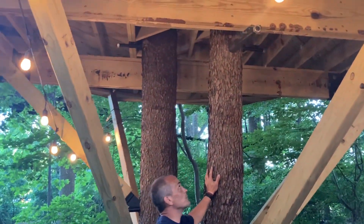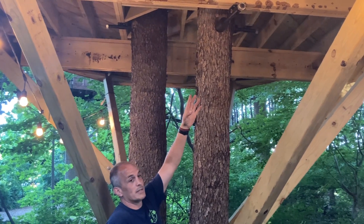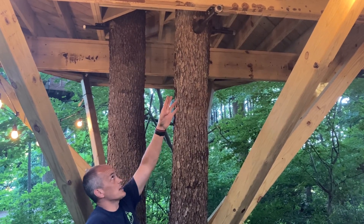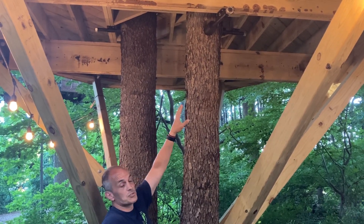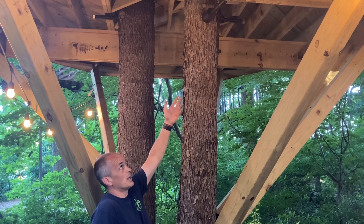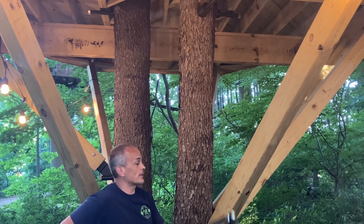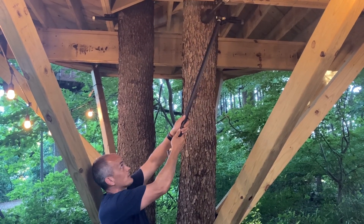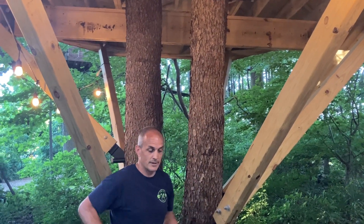This tab here is supporting a platform and you can see that the pipe bracket is installed on the extreme end of the tab. With the beam riding so far on the outside of the tab, it puts a lot of stress on the tab itself as it is embedded in the tree. This tab is stable and showing no signs of failure right now, but if this platform were loaded with a large group, it could over time put this tab in jeopardy. So what we're going to do is install a retrofit pipe bracket behind the pipe bracket in a place we couldn't reach coming in from the end of the shaft, and then install it into the tree to support this tab and give it more strength over time.